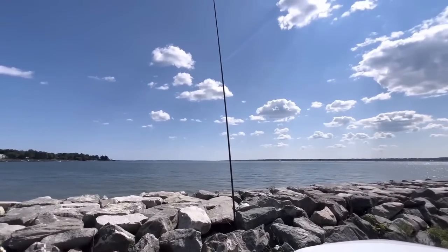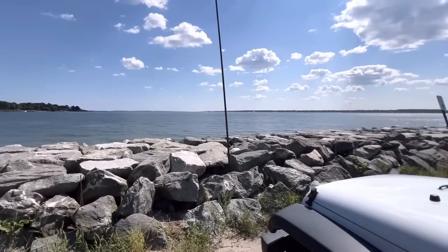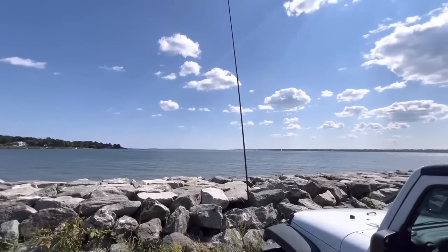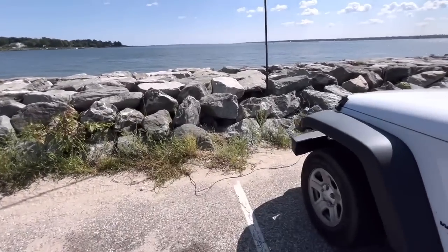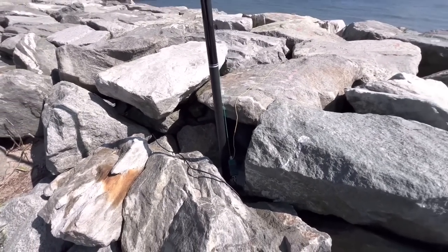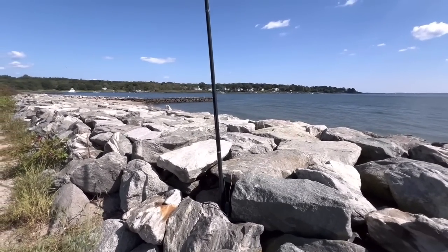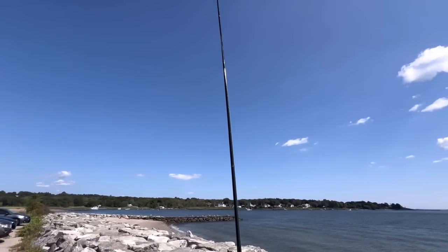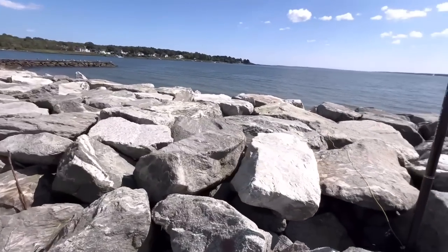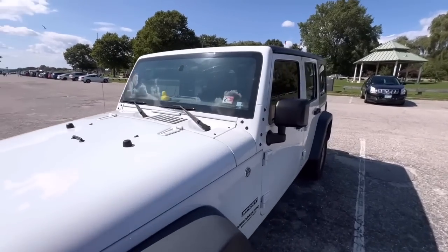Here's the antenna. You've seen me here at Oakland Beach before — this is over in the parking lot. That is due south. This is kind of a rocky parking lot area; down that way is the actual beach. That is my 7-meter DX Commander pole. I've got coax coming out of the Jeep to it. Down here is a 4-to-1 balun. I've got a counterpoise going all the way across — maybe 35 to 40 feet long — wrapped and put at the edge of the water. I've got some 22-gauge wire going up to the top of the pole. Coax is running into my Jeep.